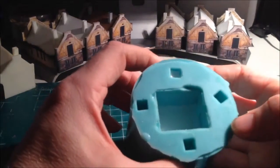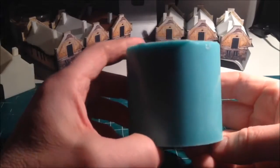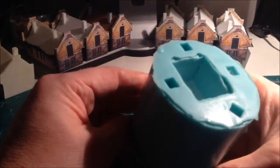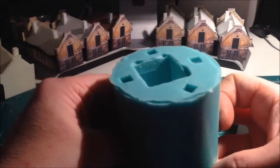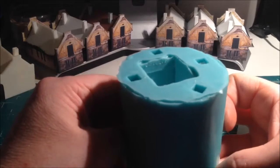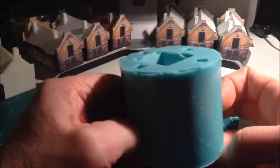This mold is Smooth-On's Mold Star 15. One nice advantage about this silicone rubber is it's a 1x1 mix by volume, not weight, and the cure time is 4 hours instead of 24 hours like the Mold Max 30.